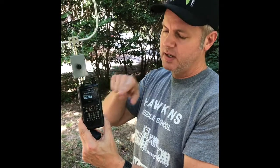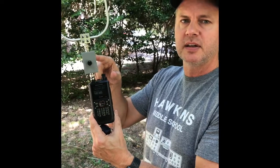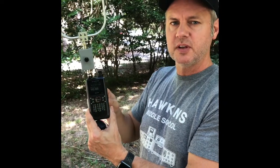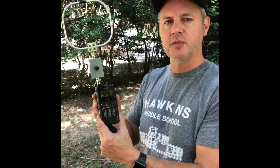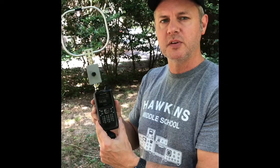The benefit of using a frequency offset attenuator is the elimination of RF interference coming in through the radio itself — so even if I take off the antenna you still might pick up a signal. Remember, the last hundred yards of a fox hunt are often the most challenging, and this is one tool you can use to help you zero in on that fox.